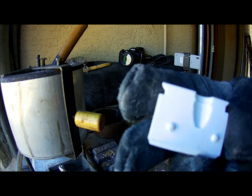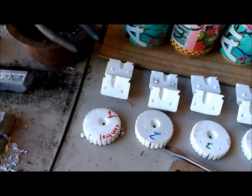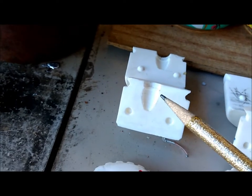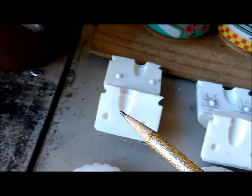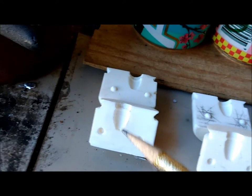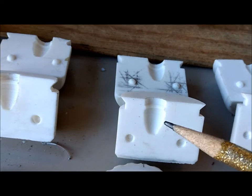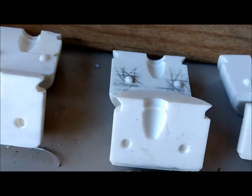Yeah, that's a mold cavity right there. Doesn't show any sign of distress or damage or anything. I just wanted to use my cell phone camera before I do the third go around and take — show you some close-ups of the mouths of these cavities. That's number one. Notice how — I don't know if it comes through in the camera — but it's starting to brown and the very edges of the cavities are starting to flake. This is what was happening last time when I used the factory formulation. I'm casting at probably about 100 degrees less temperature, and I'm removing the bullet from the mold a lot quicker. This is a single tablespoon of additional porcelain powder, and I'm getting just the faintest hints of browning around the edges. The surfaces themselves haven't started to buckle.